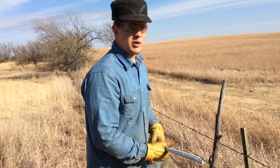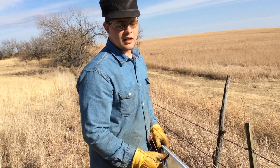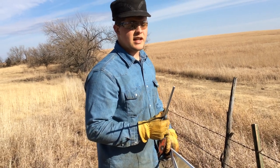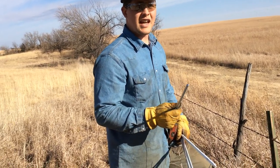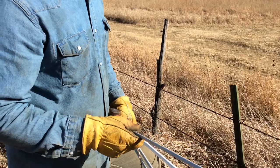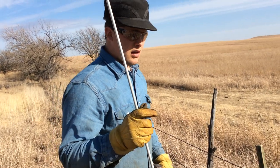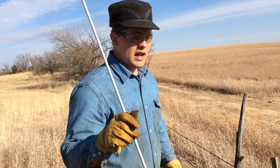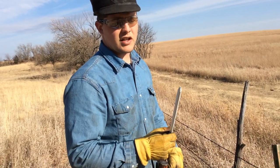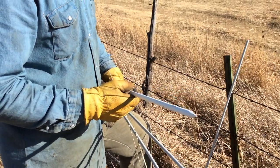I'm just putting in fiberglass stakes right now. I've already got my wire all stretched and mostly tight. Since we're trying to do this as low cost as we can, most of the stakes I'm using are these three-eighths of an inch fiberglass stakes from Ken Cove. A friend of mine is a Ken Cove dealer so I got them through him, and all we got to do is hold the wire up. These three-eighths are going to do the job for us in most of the places. And then I got some of the thicker half-inch for when we need to make a little corner or something, just to give it a little more rigidity.